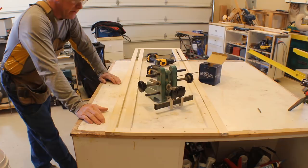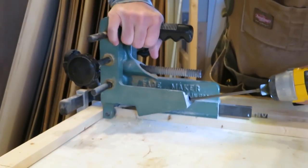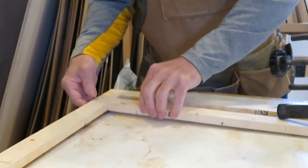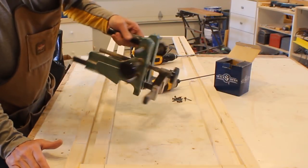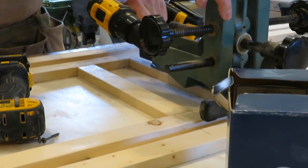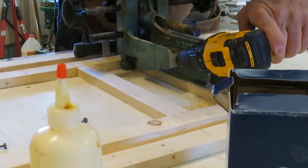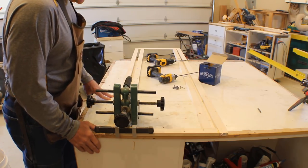Assembling the rest of the frame is an easy process. The simplest way to go about that is a pocket hole setup. There are all kinds of jigs nowadays that are inexpensive and will allow you to join pieces like this together. In my case I have a piece of equipment I bought many years ago called a face maker — it's a face frame tool. It allows you to take pieces of material you're joining together and literally clamp them in place when you make your pocket holes, giving you a good flush joint without really anything else except doing the assembly.